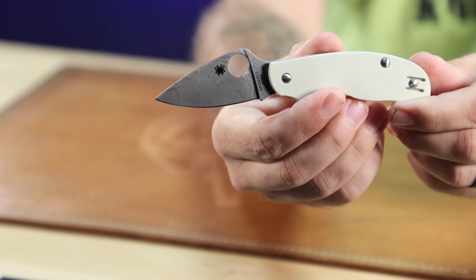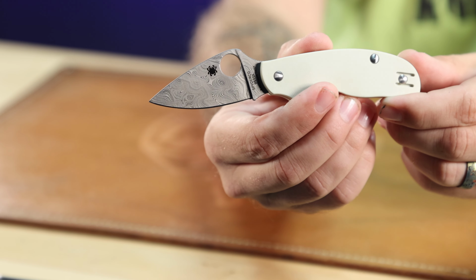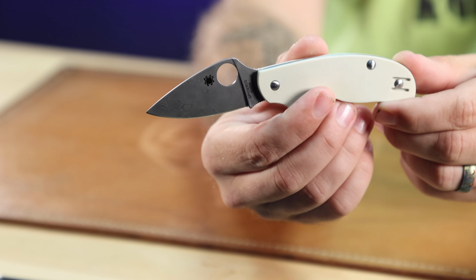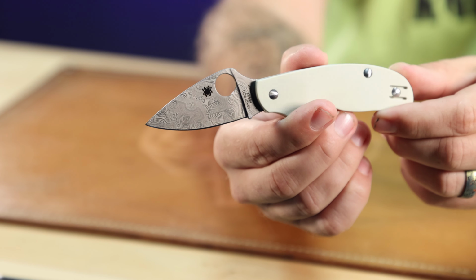So what Damasteel has done is they've taken powdered metallurgy technology and they've made Damascus out of it. They've made powdered steel plates and then forged Damascus out of those plates, which is a phenomenal idea. What you end up with is an extremely dense Damascus and a very strong steel. Now, the DS93X here was actually developed as an excellent steel for edge tools like knives. It holds an incredible edge. It's very durable, and it's also absolutely gorgeous in that Bjorkman's Twist pattern right there.